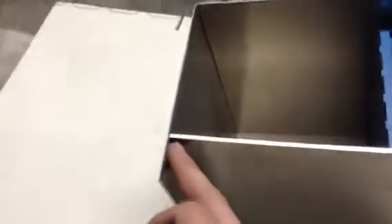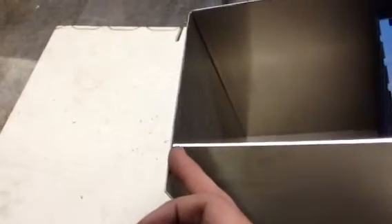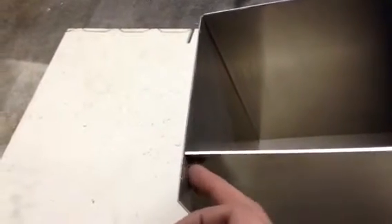If you do not have material on the outside to back it, you will blow out the aluminum — without a doubt. I've been doing this for about ten years, and that's one of the secrets: back your material.